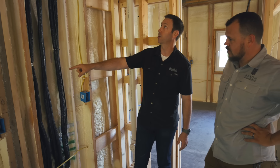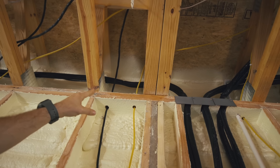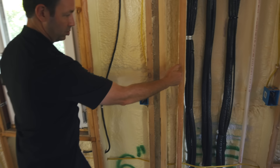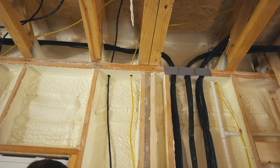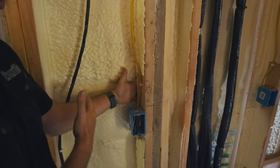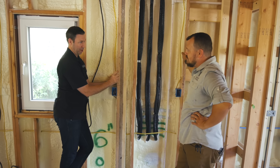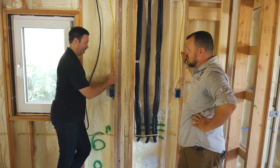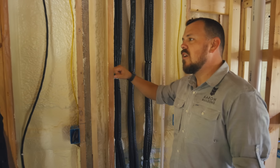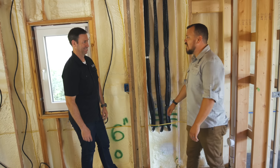This is genius — check this out. It looks like a load point right there from above. He's got two floor trusses coming down to a bearing point. This is his two by eight right here, and his other two by eight — those are on 24-inch centers. But how does he bring that load down? He's got triple 2x4s. That means your hand can slip back here behind this, as well as the foam. If the foam wasn't in, you could easily get your hand back there because you've got almost three and a half inches of air gap behind this big post which is bringing your bearing. This post doesn't have any bearing except for actual physical bearing from above — there's no reason for it to be on layout or touch both sides. That's amazing.